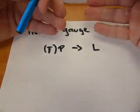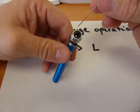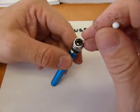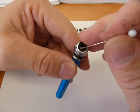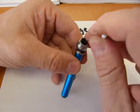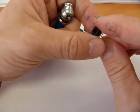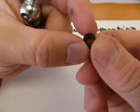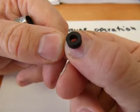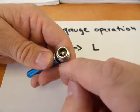I've got this one out and we'll take a look at how this idea is represented. This is a tire gauge, made to work with the automotive-style Schrader valve — that's why its size and dimensions look like this. This rubber seal needs to be intact and not chipped, cracked, or broken, because then pressure is lost without entering the instrument.